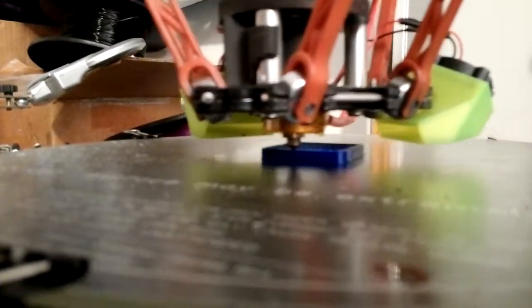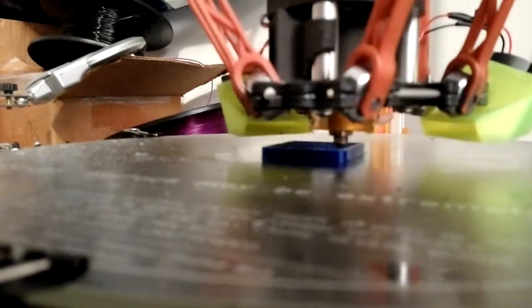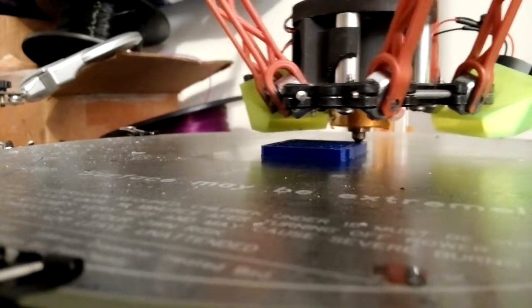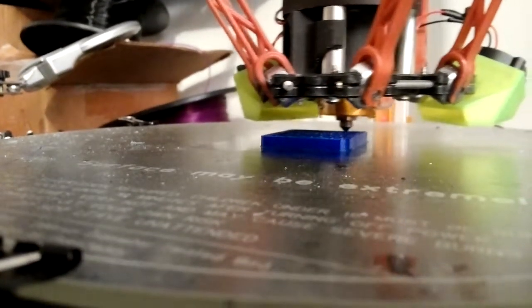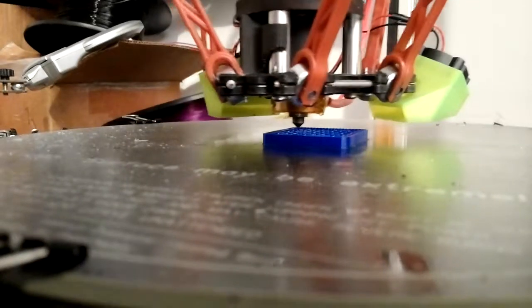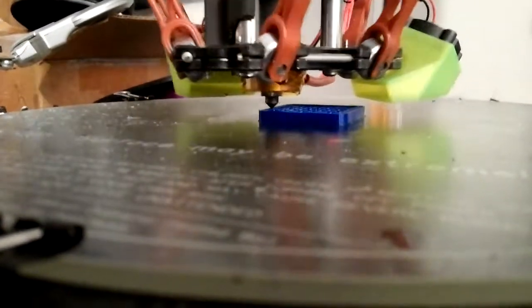The wire goes straight out the back because I didn't feel comfortable bending it 90 degrees up through the center. So if anybody else confirmed that bending at 90 degrees doesn't mess the wiring up, I might reroute that up straight through the hot-end adapter.